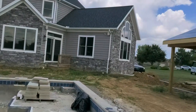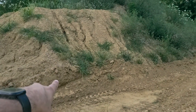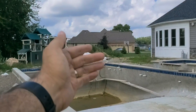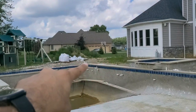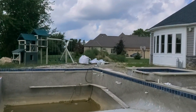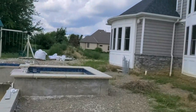Out here, what we're going to do for audio in the landscaped area: he's going to have a speaker — this will be 70-volt — out here, a speaker at his fire pit, a speaker at the playset area. Two speakers about where that construction material is, a little closer — there's going to be landscaped shrubbery in that area, two speakers in there. Those will all be 70-volt and zoned appropriately so he can have some on and some off, not all playing at the same time.